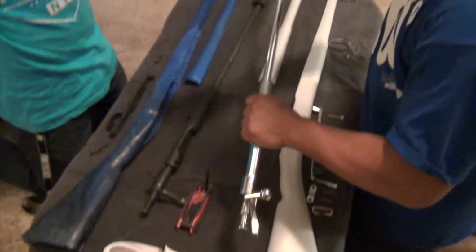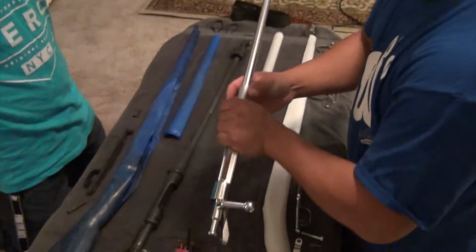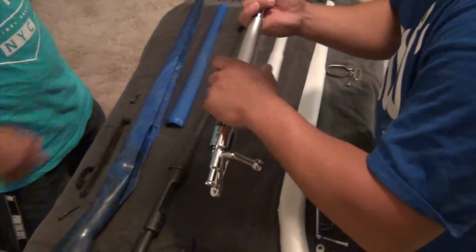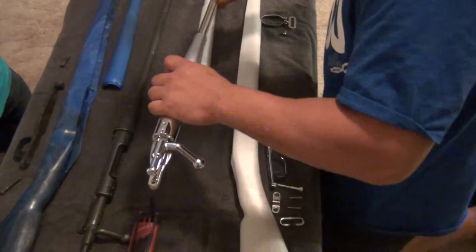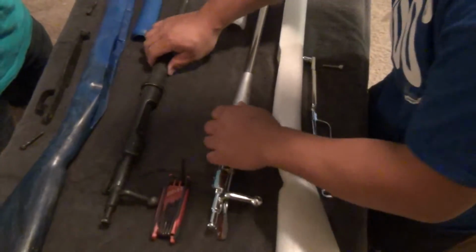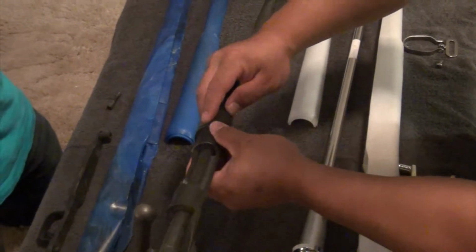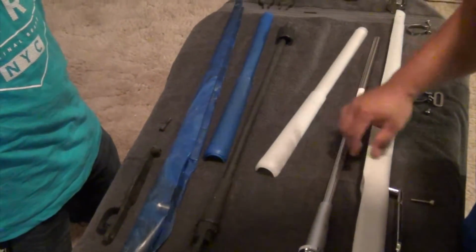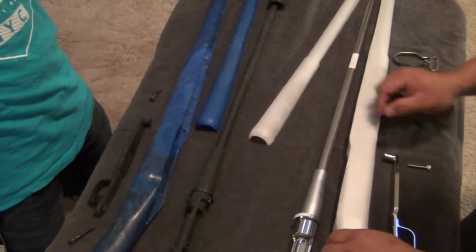Lastly, slip the receiver ring down over the now assembled barrel with the lip facing down the barrel. You'll notice that your receiver has a small hole near the front designed for a small pin to be inserted. You will not want to install this pin, and it is not included in the Glendale kits. This pin serves to hold in place the handguard of a replica rifle, but will cause damage to the underside of a New Guard handguard.